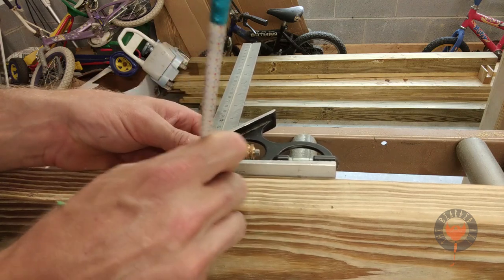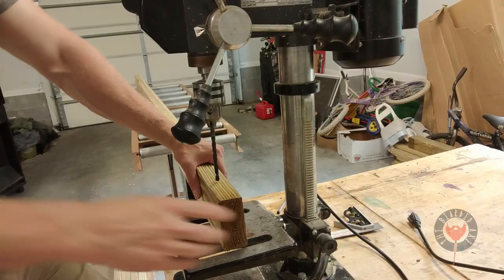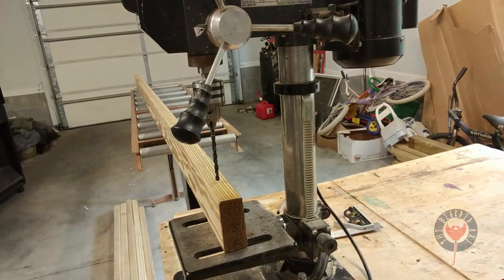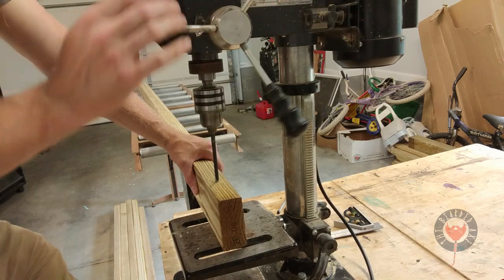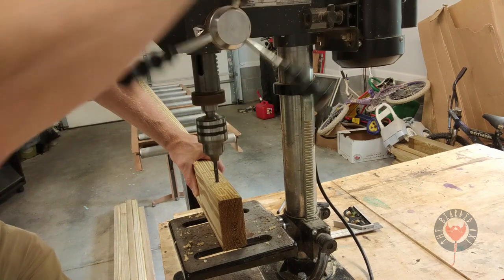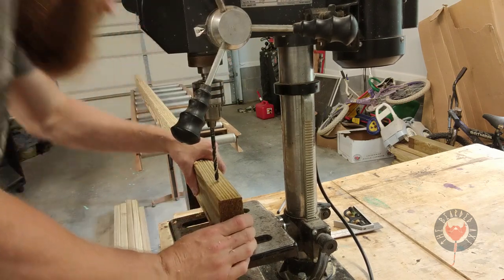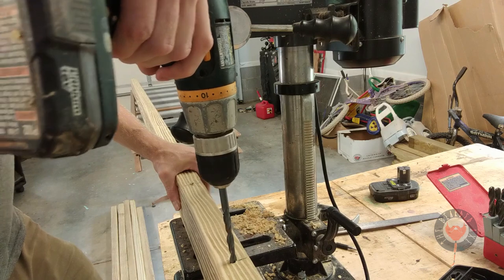The wood is extremely fresh, new, and green, so it's hard to mark. The initial hole I drilled was a quarter inch, and then we'll see how well that's going to fit with the cordage that I got. I'm pre-drilling the holes before I actually rip out the slats because it would be much harder to drill the holes after it was ripped out. The plunge depth of the drill press just didn't quite make it, so I'm going to have to do it manually with a regular hand drill — just pilot it the rest of the way.